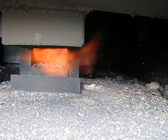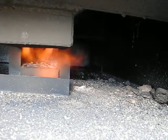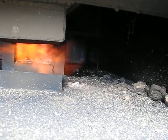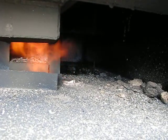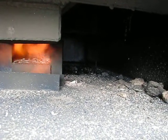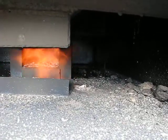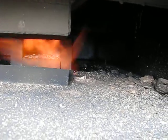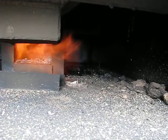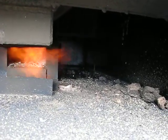The original idea was maybe we just weren't getting enough primary air in there to get it hot enough to burn. But if I do have enough primary air going in there, this doesn't burn. It burns for a minute, so it's not that there's just not enough air for it to burn. I was thinking maybe my secondary air injection just wasn't enough air, but that's not the case because it burns for a little while. It just goes out quicker if I have it wide open.